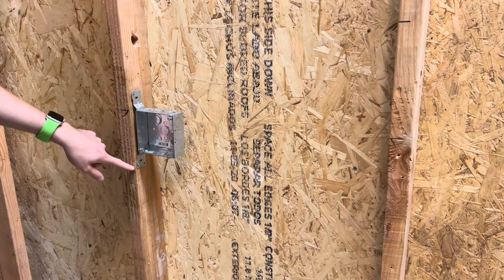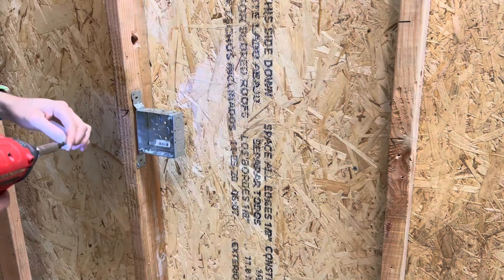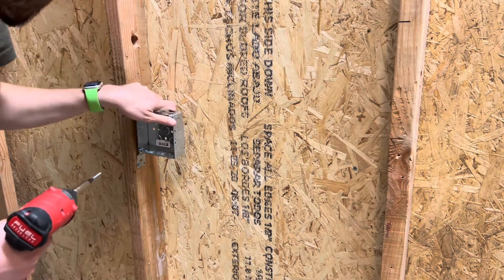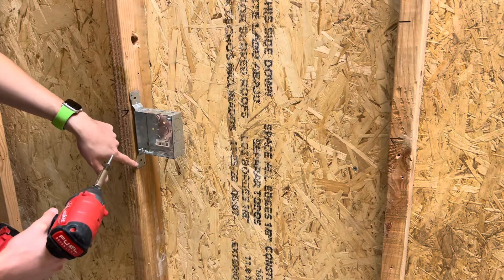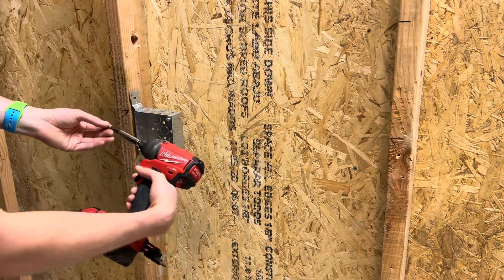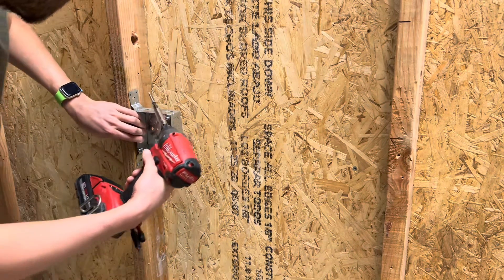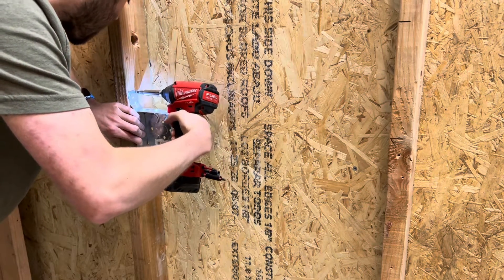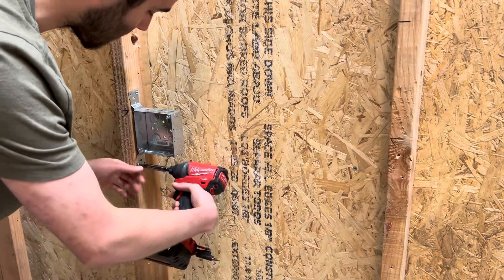This one moved back a little bit but that's okay, we'll fix that. That'll be a nice placeholder. Make sure our box is still lined up, bring out the top bracket and line that one up, then move the second one after. If you don't get in the center of the screw hole it's going to push your box left or right, so you want it as centered as possible. Once you have it, grab your box and screw it in the center of the hole.